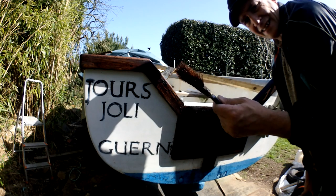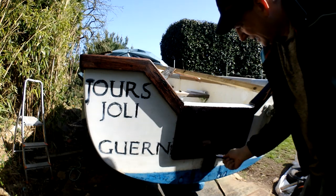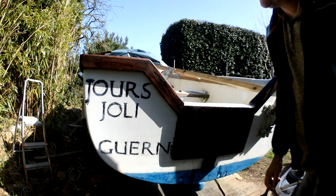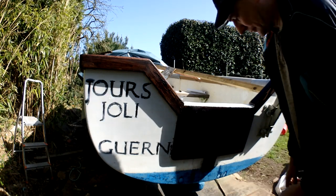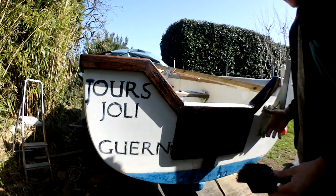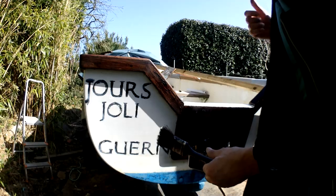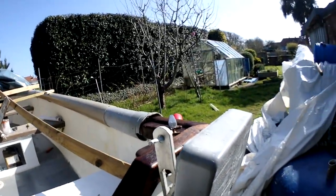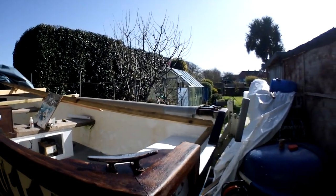This is basically stained wood wax. I put a bit of floor wax into it to soften it, then it goes really hard. Afterwards I'll go over with a clear coat of floor wax again and it'll harden up. I do this every year rather than trying to varnish it — on a working boat the varnish gets chipped, water gets underneath, it starts to flake, and it's terrible trying to clear it off. This is the best way I've found. We did the box as well. I'm just doing this bit for now — I'll do the top tomorrow after I pull the cover off.